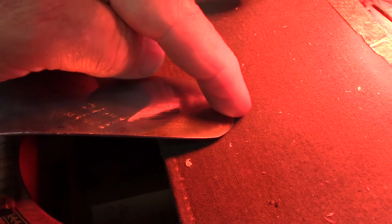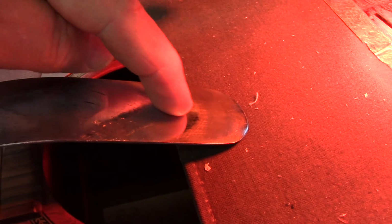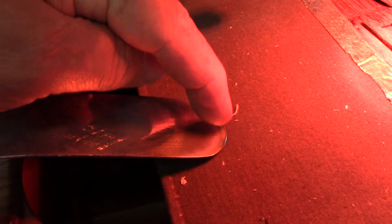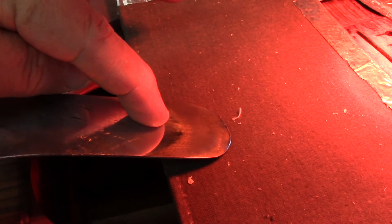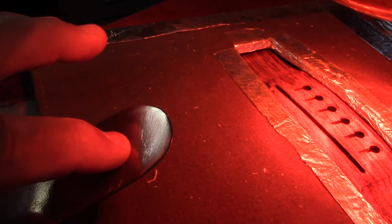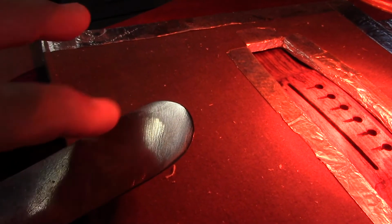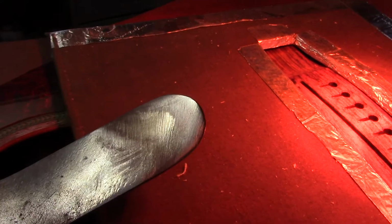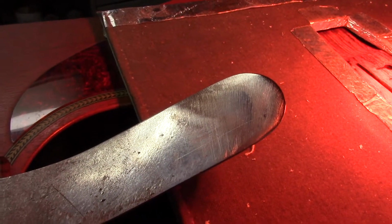On the underside, there's a very shallow slope, almost an inch from the leading edge into the body of the probe. On the other side, it's a little bit steeper. It goes in, you can see the tooling marks there. It goes in about a half an inch. This edge is buffed. That is like a scalpel, super sharp.